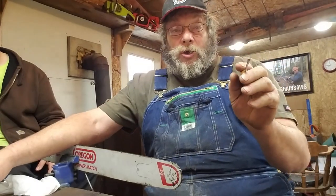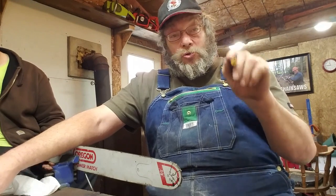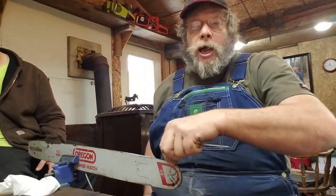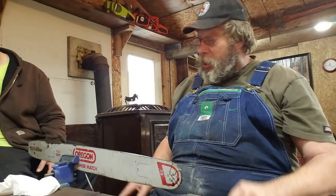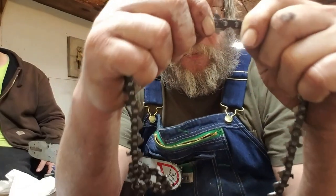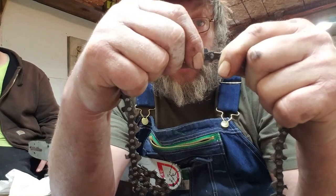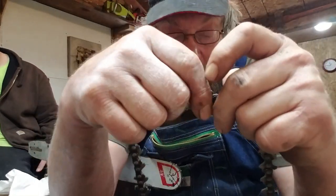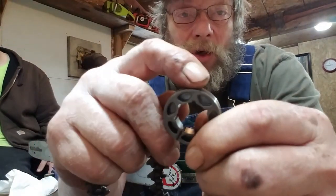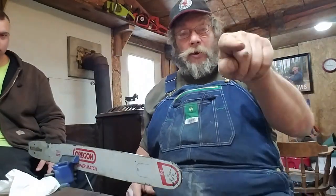I'm going to be able to tell how many of you watch this to the end. How many of you have screwed up your sprocket already by running your chain too tight? And it won't glide, like what Buckin showed you. It goes clunk, clunk, clunk. That chain stretched. Take your chain and move it like this. You'll always get a little bit because you'll get some initial stretch. But if it goes clunk, clunk, every place that it goes around, that chain is longer than each one of these. So it goes tunk, tunk, tunk. That's what it does. That robs horsepower.